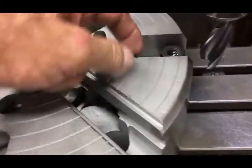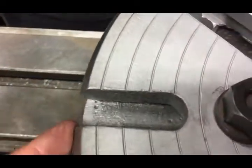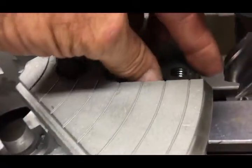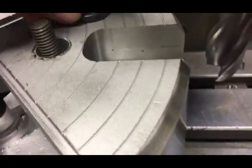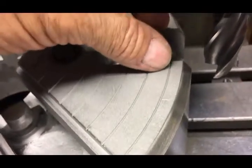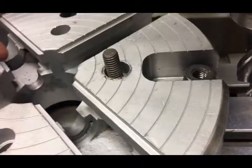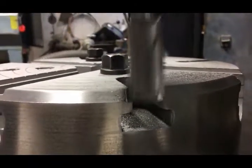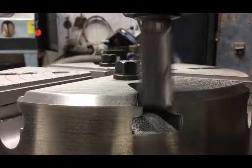I did not want to use those holes for clamping it down permanently. I wanted to come all the way to the outside, real close to the outside ribbing, so when you tighten it down there would be no distortion or very little distortion. If I had used those holes closer to the center, there was a void underneath and I felt like it would have tweaked and kind of put the chuck in a bind when you tighten it up.